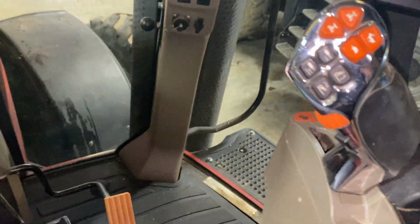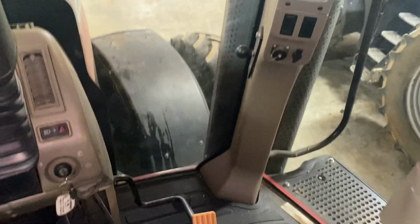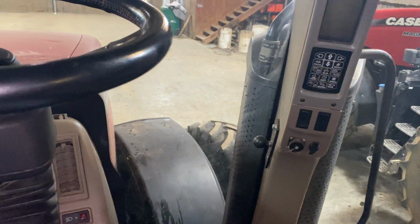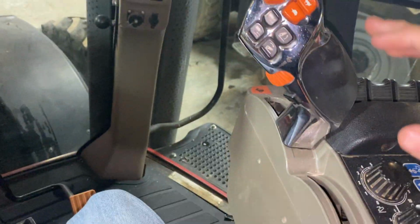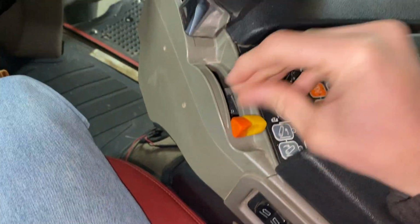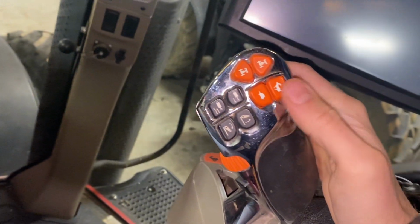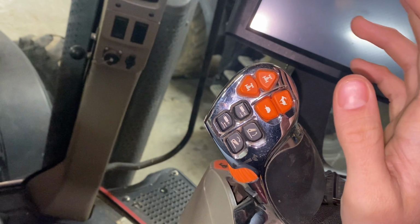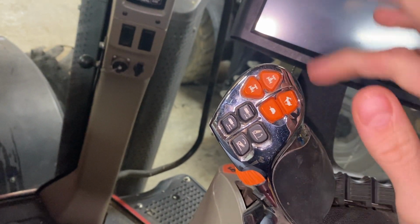But this tractor, like I said, has all leather interior, leather seats. The PTO has the 540 and the 1000 PTO, which is awesome. So we're gonna do this. You've got your split throttle, which typical CVT transmissions have, but this is your knob right here. It's just your speed. You can go rabbit or turtle. You can have different ranges set for your speed, three different ranges you can go through.